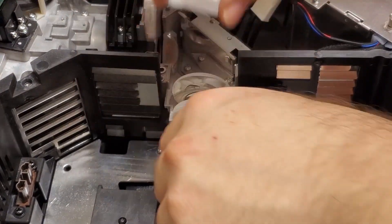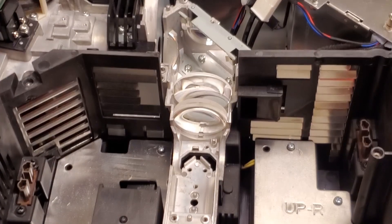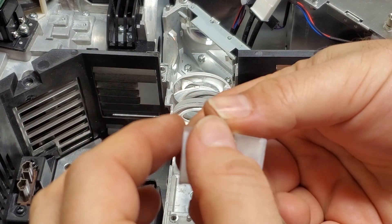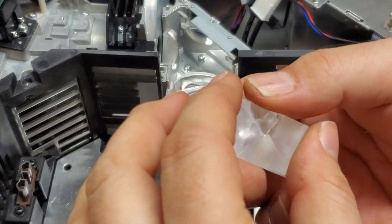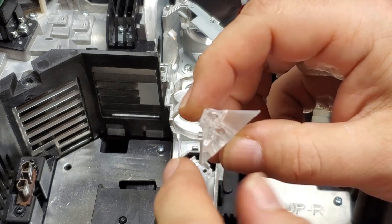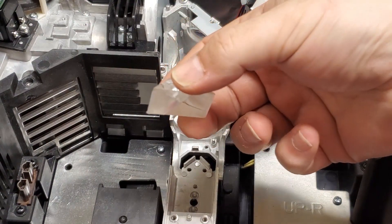Now we have the spring. Wow, look how hot that got — that's from the UV or IR shining through. And you can see the owner had some tape — they wrapped it in scotch tape just to kind of hold all these pieces together. That must have been a fun puzzle. So that's what's left of it. You can see it got so hot that the glass, or this might even be quartz, started to melt — it's rounded out here instead of just cracking. There's a mirror coating here and a mirror coating here, and this whole piece is what has to be replaced.